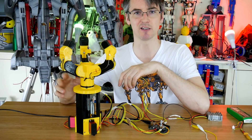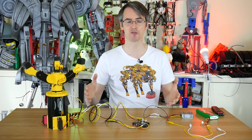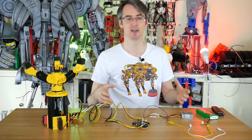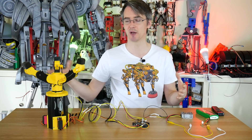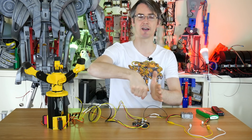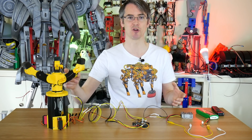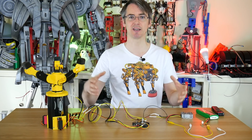So I think the basic concept is there, we just need a slightly different revision. So now let's imagine we have a whole robot arm with compliant joints which are force controlled — that means we could just grab the end effector and move it and it would comply with us. We could save that position because we know what the actual joint position is, then move it to another position and save that position. Then we could turn the force demand up and have it replay those positions. With other end effectors, we could also use it to collide with something and work out how much force it needs to push it, so we could estimate its mass and lots of other useful things. The end goal is to make a robot arm with a force control gripper and force control joints so we can either apply force or measure force and make it comply for training.